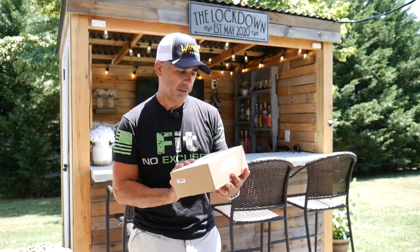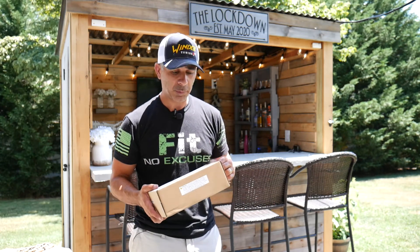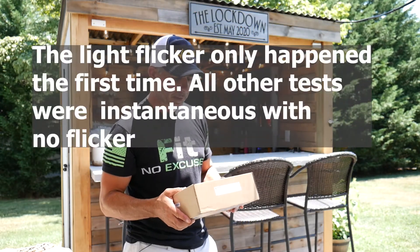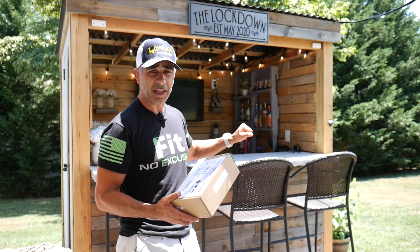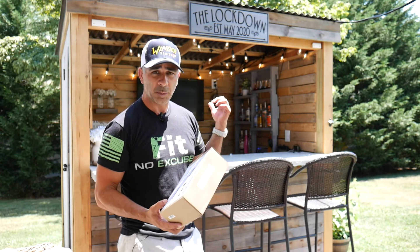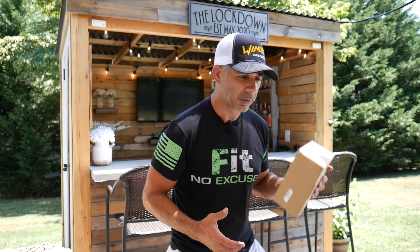That about wraps it up for the install. This is the Pro Watt 15-amp transfer switch — it's an automatic transfer switch, so it does it automatically without flipping any switches. It works within milliseconds. You did see the lights flicker for one second as it transferred from house to solar and vice versa. I do have mine set with solar as the priority, so as long as both things are plugged in, it'll run off solar until I shut the inverter off, then it'll automatically go over to house power. I'll put the link in the description. Thanks for checking out the video — feel free to check out bar build parts one through ten here on YouTube, or like and subscribe. If you have any comments or questions, make them below and I'll be sure to answer as soon as I can. Thanks for tuning in.